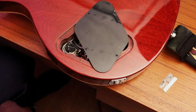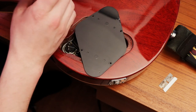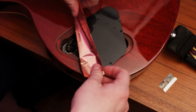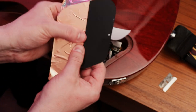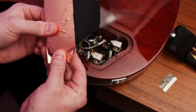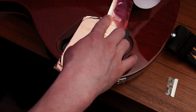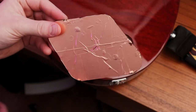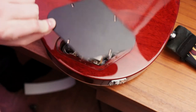I'm going to take some off here and literally just completely cover the back plate. I should probably dust off the back plate first so it's adhesive — just a bit of dusting. It shouldn't be too sticky. And I'm going to take the copper tape now and just completely cover the one side. Try to smoothen it down as best you can just to make it look a little pretty. Obviously this is not the side that shows. You should probably actually just cut strips but I'm just doing it quickly here just to show you guys. So this is what it's supposed to look like at the end — just make sure that the inside panel is covered in the copper tape.